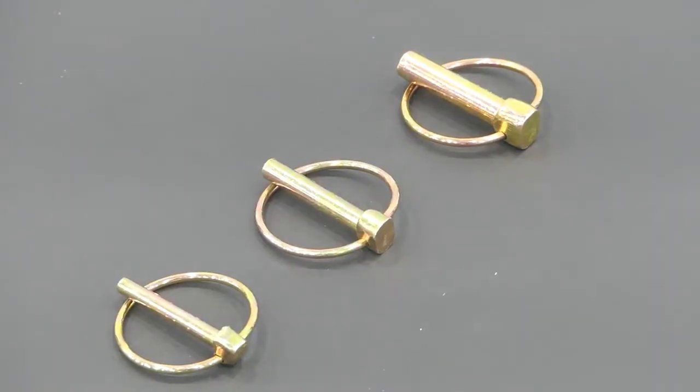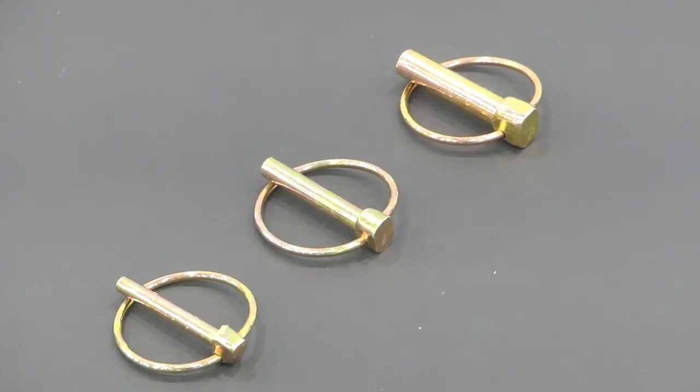You'll also note that these have a brass or coppery type finish even though they're made from carbon steel. The finish is the result of a zinc dichromate electroplating process. Zinc forms corrosion byproducts that significantly reduce the corrosion rate of ferrous metals. They form a protective barrier on the metal surfaces and help keep out moisture, which can significantly reduce the speed of the corrosion process — giving the zinc-treated surface the ability to resist corrosion by a factor of almost 100 to 1 compared to untreated steel surfaces. The zinc acts as a sacrificial coating; the zinc coating will always tarnish and corrode first, thus protecting the steel.